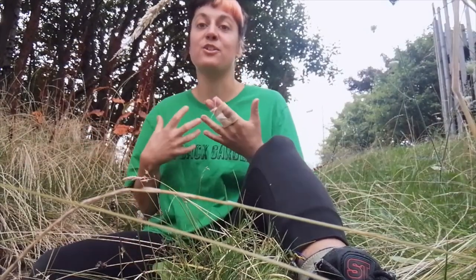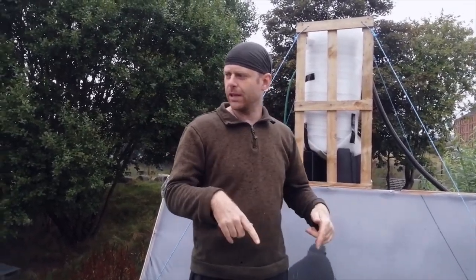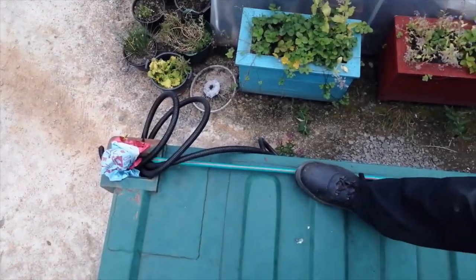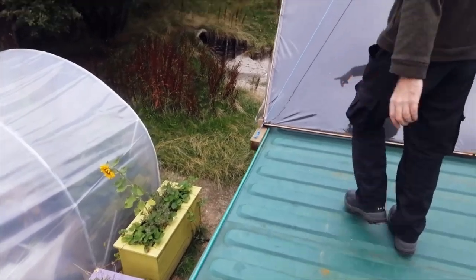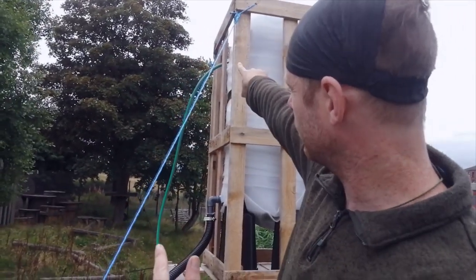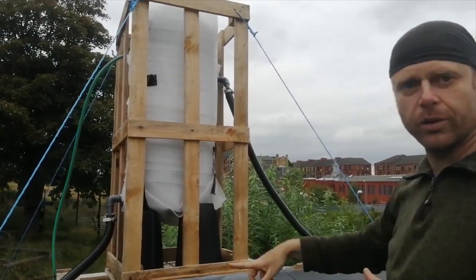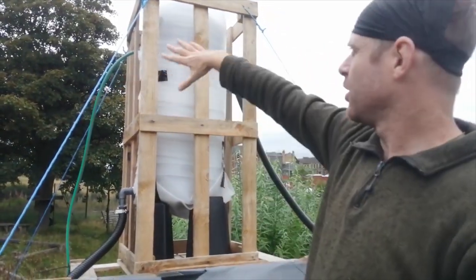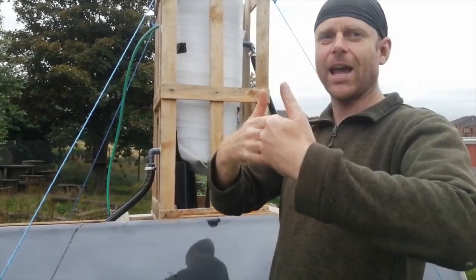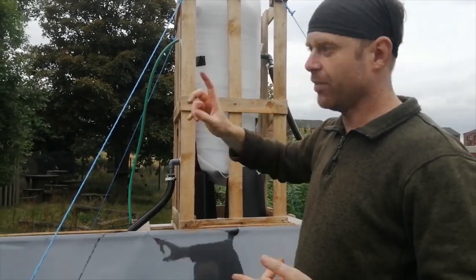Which means that the kids who come to our sessions will be able to wash their hands before, during and after sessions, helping us to adapt to COVID-19 and the challenges that it's bringing to this community. So the way that this is used is we have this little tap down here which is just mains cold water. That has a hose which comes down, is buried, comes under the ground and up to here. Runs along here and then goes up into the tank, and in the tank is a coil of copper tube which the hose connects onto, and then it comes out the other side and it goes down to the sink. The copper tube is sitting in the hottest water at the top of the cylinder and so it gets hot because copper is a conductor, so it basically sucks some of the heat out of that hot water. The cold water becomes hot then goes down to the sink and that's your hot tap.